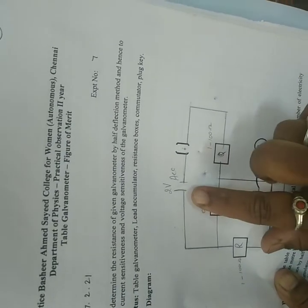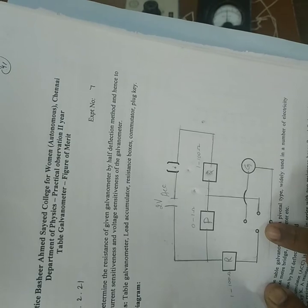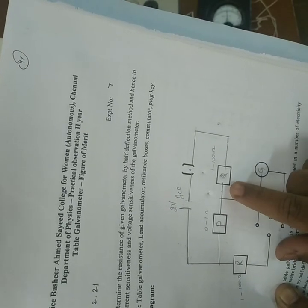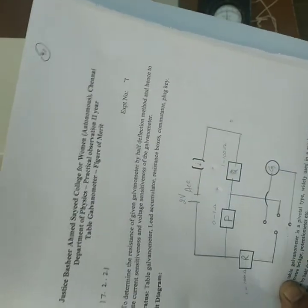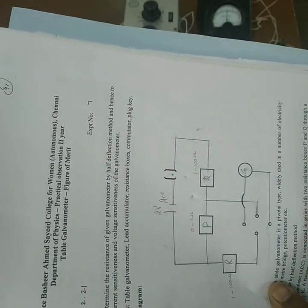This is the circuit to be connected. The connections are in series: from the positive of the battery to one end of P. There is no positive or negative terminal for P, Q, and R. From P, take the wire and give it to R. The other end of R goes to one end of the commutator, and the other end of the commutator connects to where P and Q join. The other end of Q goes to the key, and the other end of the key connects to the negative of the battery. The top of the commutator is connected to the galvanometer.